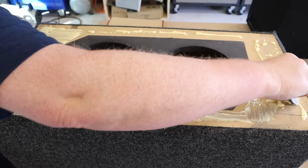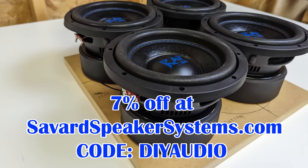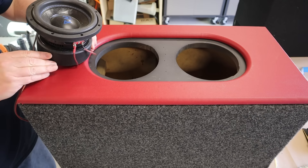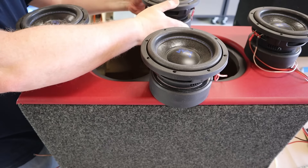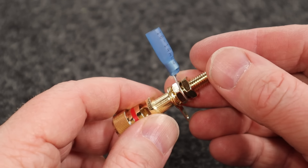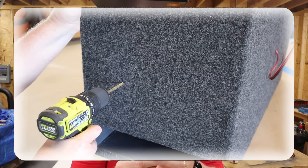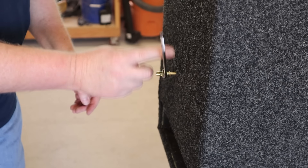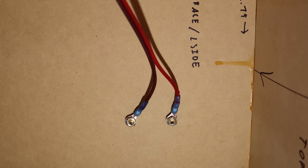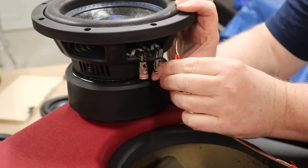Now I've got to attach that outer baffle to the rest of the enclosure. I'm gonna be using some wood glue and then use these beefy little 6.5-inch subwoofers as weights. Wood glue is very strong stuff — you just need a way to hold the pieces together while the glue dries. While that's drying, this is a really good time to go ahead and install some speaker terminals. I'm using a set from Parts Express — it's basically a bolt with two nuts. You drill a 7/32-inch hole, which is just tight enough where you've got to thread it in, then reach in and screw down the first nut. When wiring up the box, I'm gonna crimp on some ring terminals and screw them down. These subwoofers are all dual 4-ohm, so wiring everything in parallel will get a 1-ohm nominal load at the speaker terminals on the side of the box.